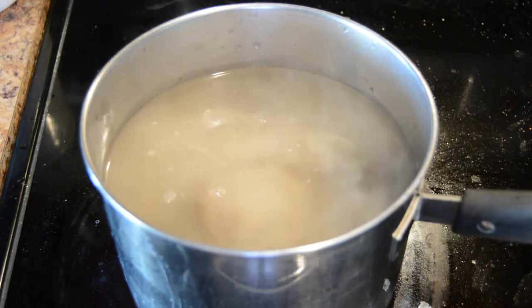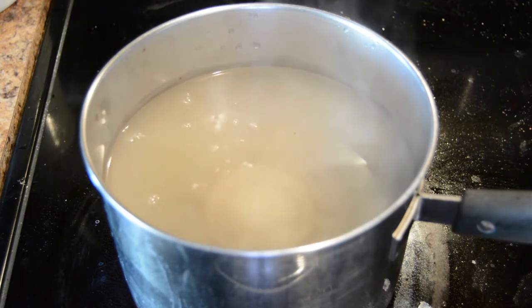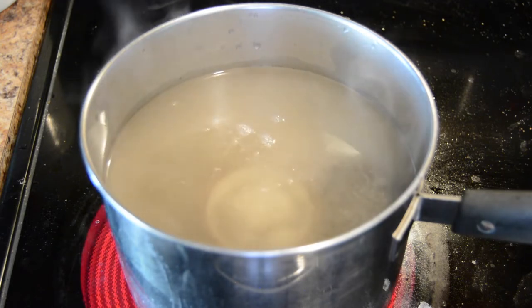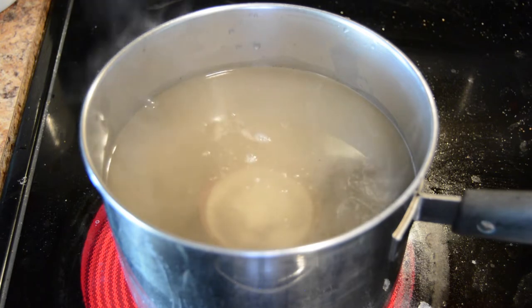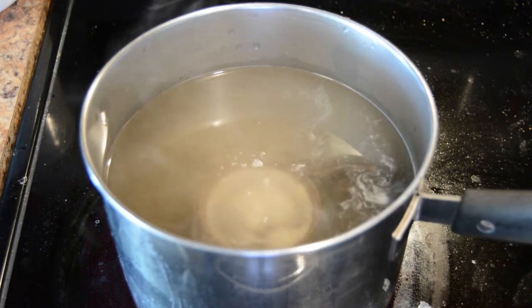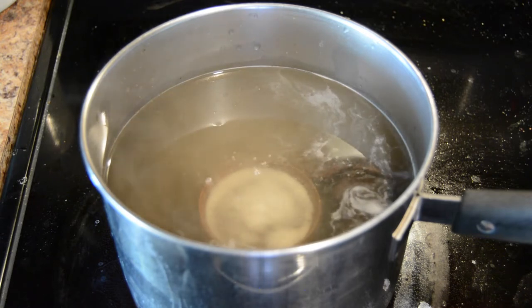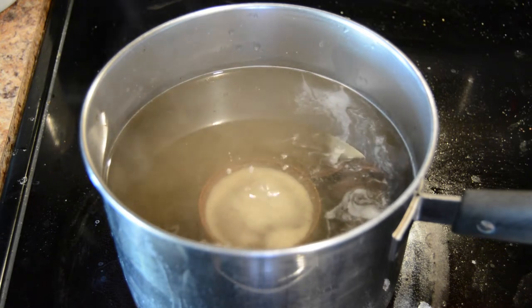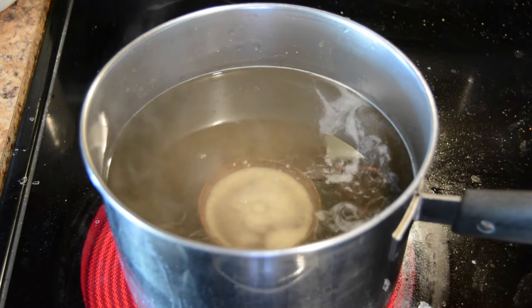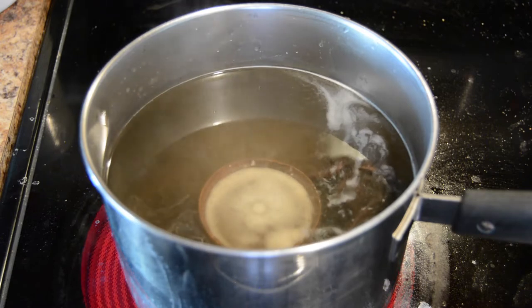during the electrolysis and vinegar cleaning methods, whichever method you might have used, vinegar or electrolysis, or both in this case, that's going to neutralize all that stuff before we treat the shell for permanent display. So mix some of that in there. We're going to bring it all to a boil and repeat the process several times. And then we're going to bake these pieces of artillery in the oven to dry out any excess moisture. And a word of caution, always do this procedure when your loved one is not at home. So with that, let's watch a pot of water boil.